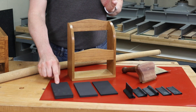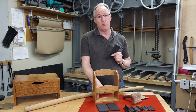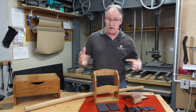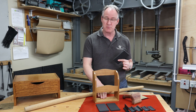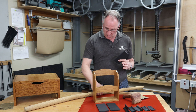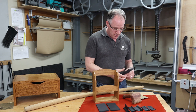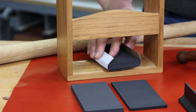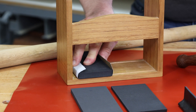The thickest of the three flat pads is really good for getting into corners of assemblies you've already put together. We try to clean things up before assembly, but you've got to get in later and do some sanding as well. With just fingers — being rounded — you're never going to get right into the corner. So we take a piece of paper and sand right up into the corners.